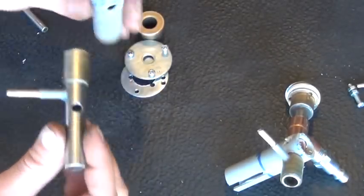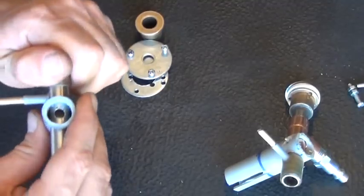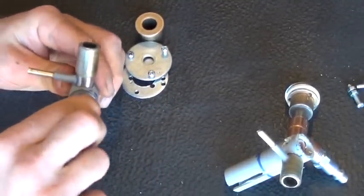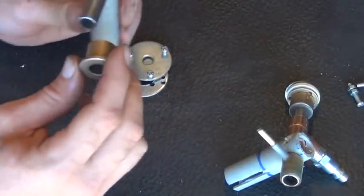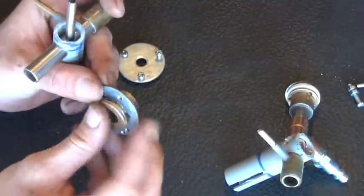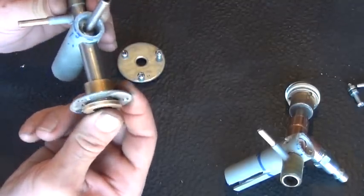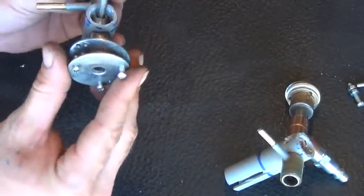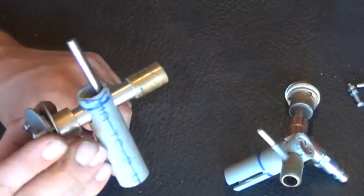Let me go ahead and set that all back into place one more time for you, just so you can see. So we slide the tube through there, just like that. Align that hole out the top. You can go ahead and press in our pipe there, so that way it sticks out, ready to go. We've got to put the rear washer on, so we take the rear washer, put it over the brass bushing. Actually, one side works better than the other, so let's go around that way. So that just sits there now, goes right onto that stainless pipe perfectly, and then we've got our front washer here, and we put that all together, and basically right there is all you're going to need to make a laser function. That's a nice little tube setup.